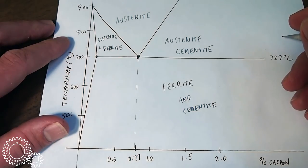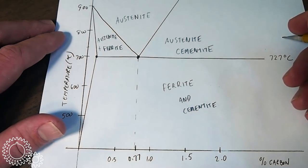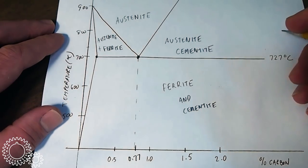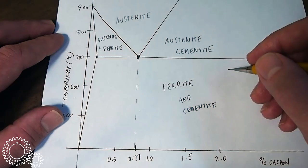In heat treating steel, our goal is something called martensite, a very hard structure that is formed when austenite is quickly cooled. It is this martensite that transforms our machinable material into something that can cut non-hardened steel. It's important to note in the hardening process that we must transform steel into its austenite phase.